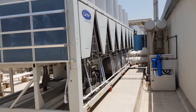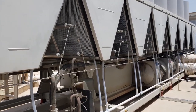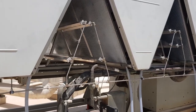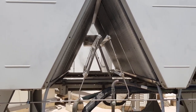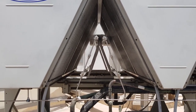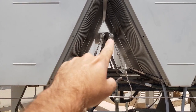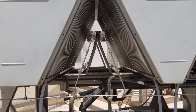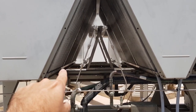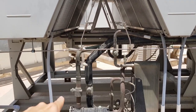The system is now fully operational and we are dropping down 14 degrees of ambient air temperature reaching the condenser coil. The condenser coils are protected with an evaporative protecting membrane, which does not allow water to contact the coil. Water is collected in the drain profile and routed to the drain pipe.